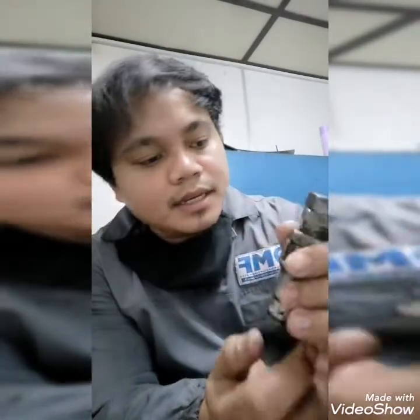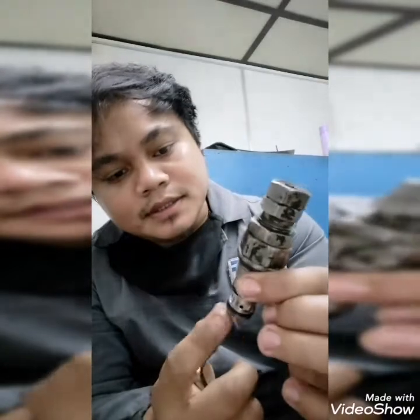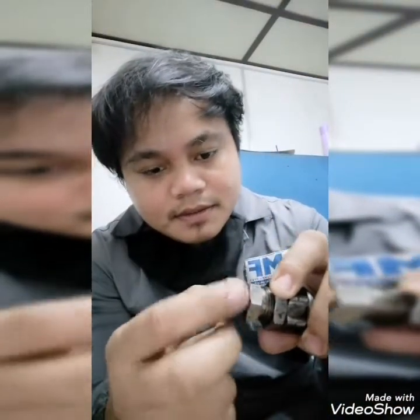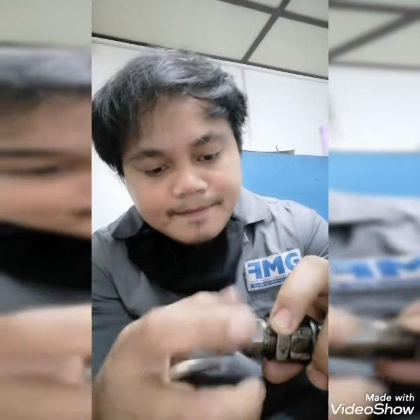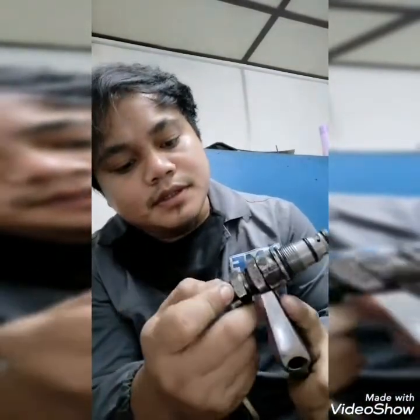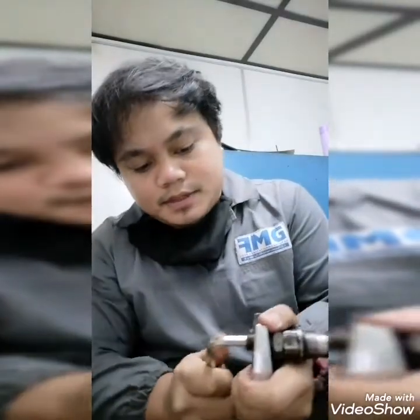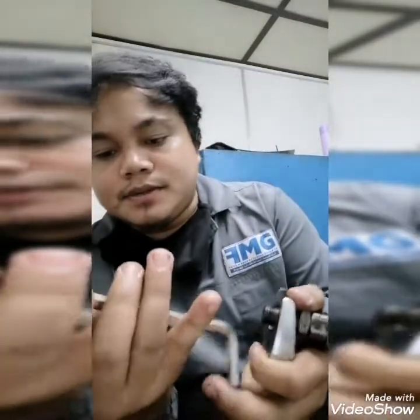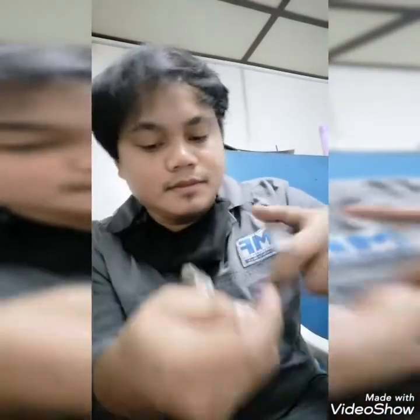Because this is usually mechanical. First, I will need to dismantle this. I actually already loosened the nut. And then I need also the wrench on this. I use an 8mm Allen wrench — this is the Allen key wrench.